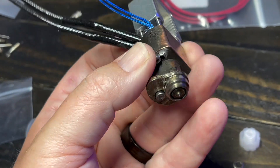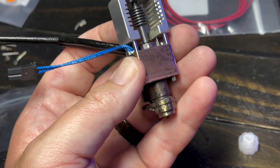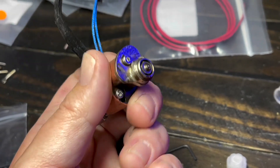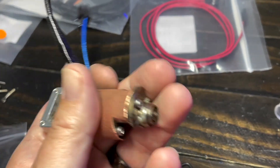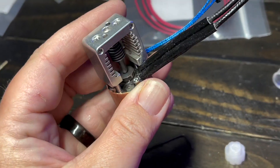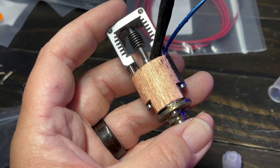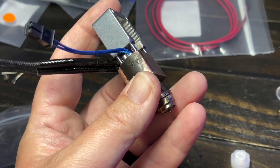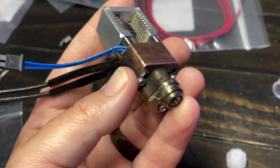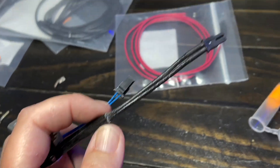This has the vanadium 1mm Slice nozzle, a Slice 50-watt heater, and a generic E3D-style thermistor since I don't plan on going above 300°C. For high-flow capacity, there is no better hotend on the market. With two heaters in this thing, your printer cannot print fast enough — this hotend produces plastic faster than your printer can handle, even with 400mm/s machines. This is easily on par with or far above even a Nova hotend, which is still a very good single-heater hotend.